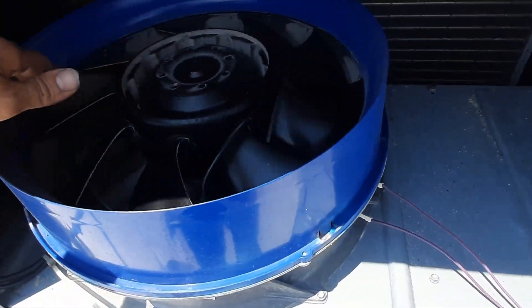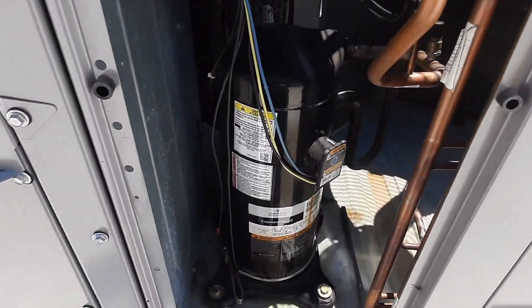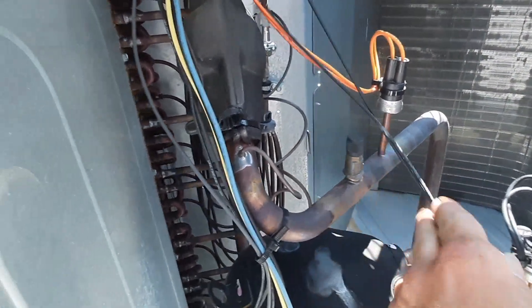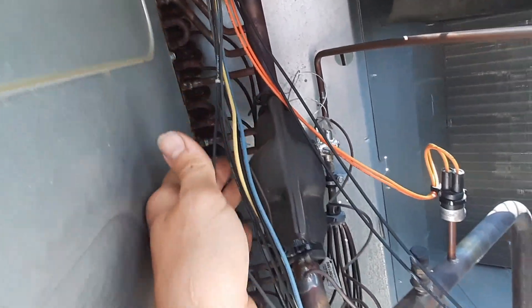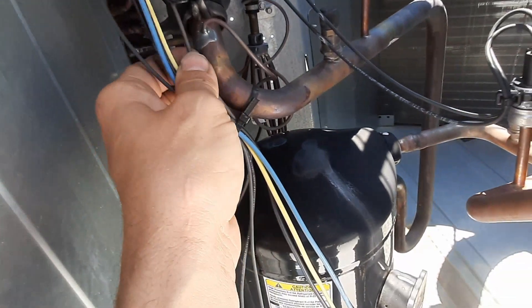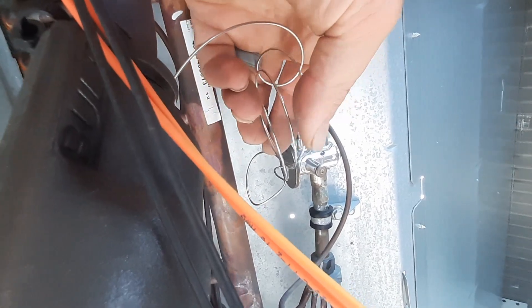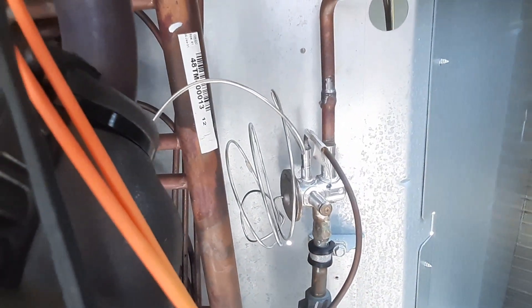I didn't find my breaker yet, I don't have access to much, so I'm not going searching because I still haven't talked to the guy. I got a dusty blower but it's spinning — this is one of the ECMs. Here's your low voltage short, and there's some more low voltage shorts. We need to get some of these secured a little better. There's an unloader on the back and there's your cap tube rubbing — on a Carrier unit, a cap tube that's rubbing. That took two seconds to fix and now it's not gonna rub.